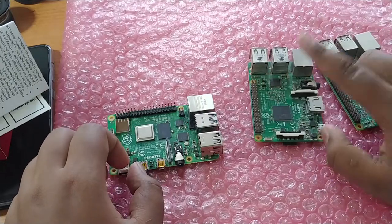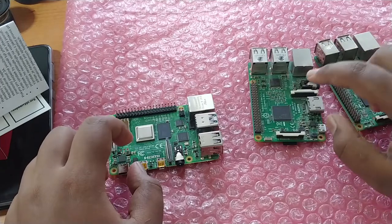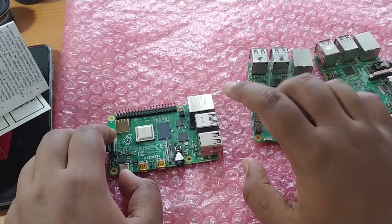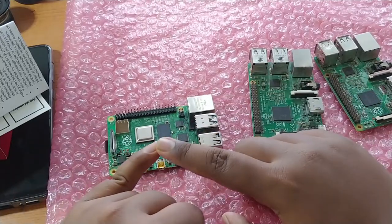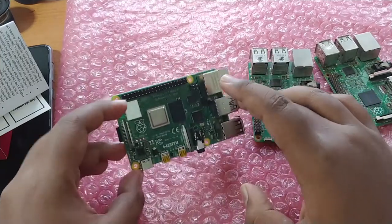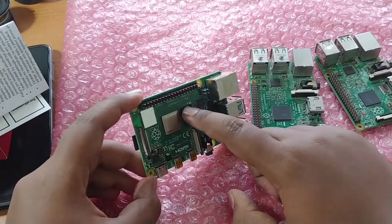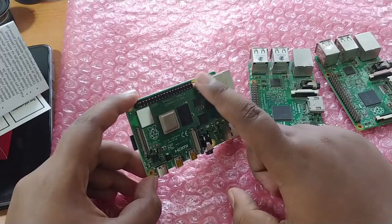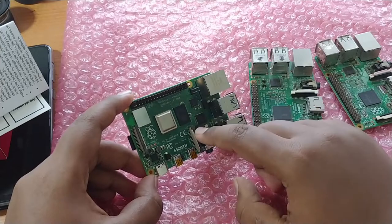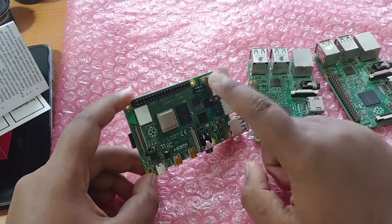The older Raspberry Pi 2 and 3 had LPDDR2 1GB RAM. The Raspberry Pi 4's RAM module is LPDDR4, available in 1GB, 2GB, or 4GB versions. All versions use only a single RAM IC — they didn't use dual sticks — so it's a single unit regardless of capacity.